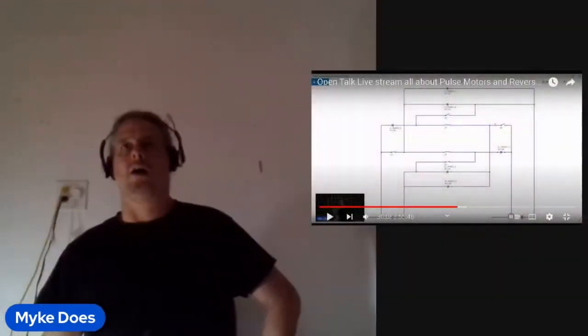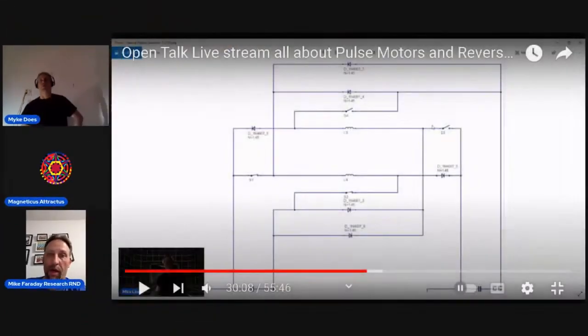Now I'm getting it. I see the COP happening here. My motor has one drive coil, and I have six pulses per revolution. So mine's actually drawing a little bit more power, and the duty cycle's a little bit higher. But you have to put into perspective, my wheel's larger, so I have more pulses per revolution. I'm under, say, 35% of the time that the wheel's spinning that the power's actually on. The rest of it, it's off and generating power. So it all has to do with duty cycle, how long the actual power has been put in.